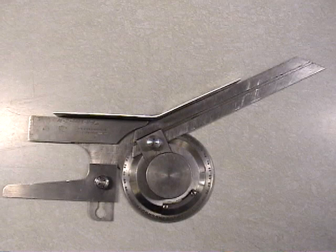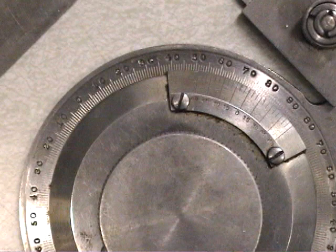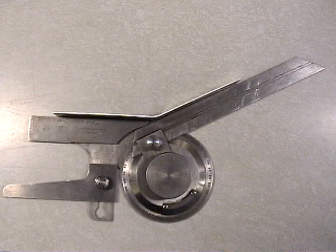As each part is formed, we can measure the resulting angle using a machinist's protractor. This is a difficult measurement and must be made with care. In this case, we can resolve to better than 1/10 of a degree, but it is important to stay tangent to the flanks of the part.